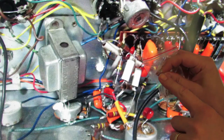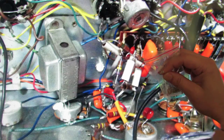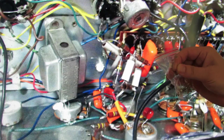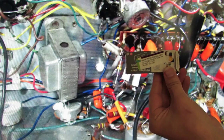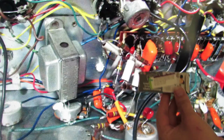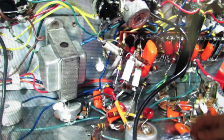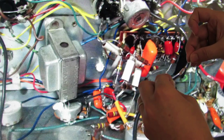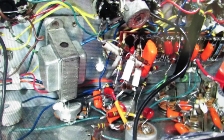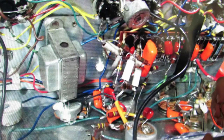You have a photosensitive resistor here on the end that's sensitive to light, and you just basically take one of these little lamps, and here are the lamps that I used. You can get those at mimotronics.com, and they are little neon lamps, and the ones that I bought actually came with a little resistor that you can run in series to protect your lamp. But what you do, basically, put these end on end this way, and encase them in some shrink tubing, something of that sort, and then you end up with your tremolo roach.